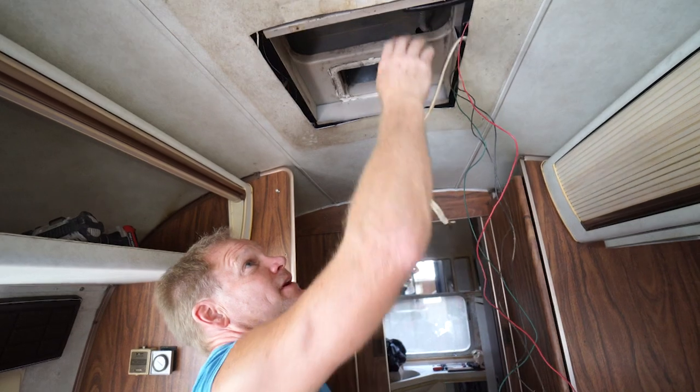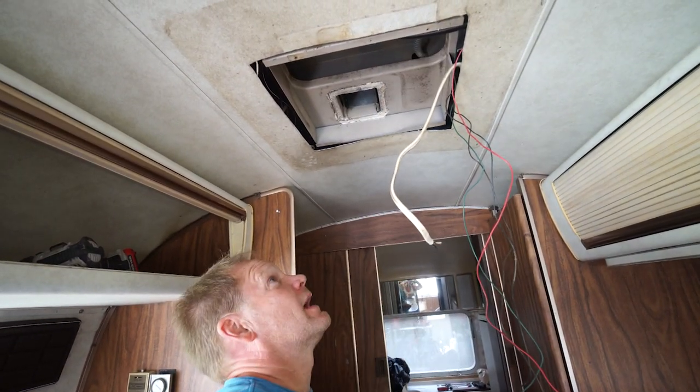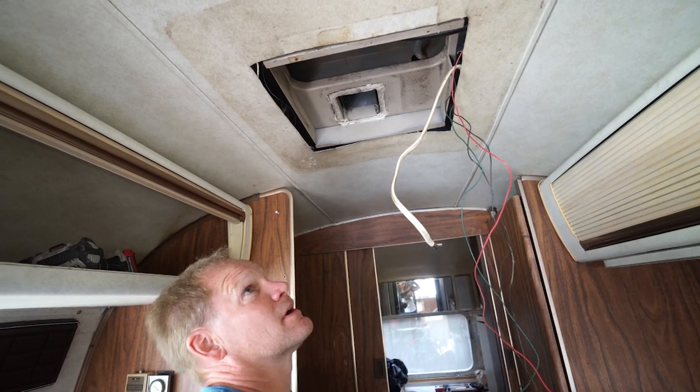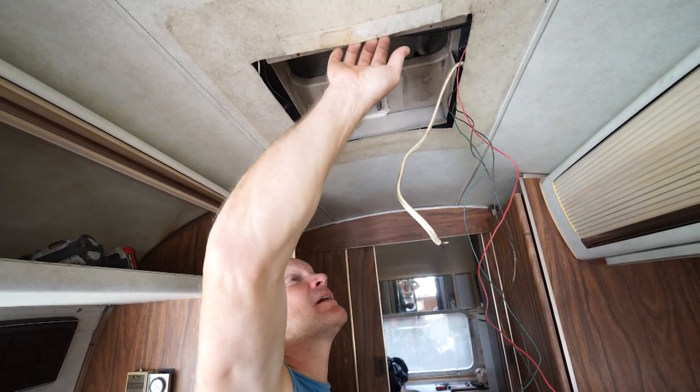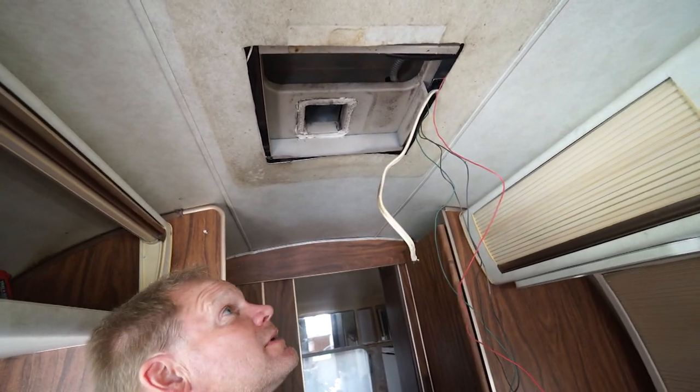Up in here we've got the old drain line. This is how these old ones work — they drained into the inside, and this drain tube goes down through the walls and works its way out the bottom of the Airstream. But you're leaving yourself a lot of room for things to go wrong with all that water flowing down behind your walls, as we can attest with this project. The new air conditioner we're putting in is a Dometic and it doesn't have a drip tube — it actually just drips on the outside of the camper. We've got all the wiring loose and the drip line removed, but I'm not sure what's holding this in here, so let's take it topside and see.